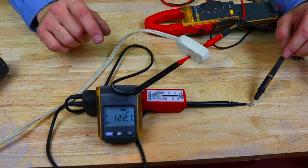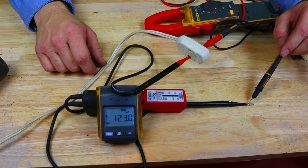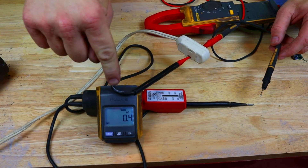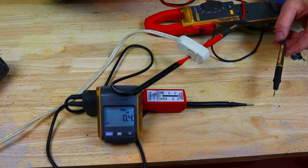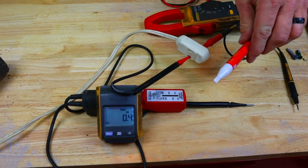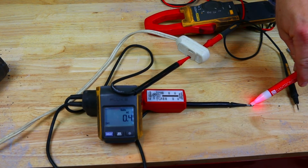Believe me, when you've got 277 and you grab the other end of this lead right here where I'm tapping, it will light you the hell up. So you can see here are the two Fluke leads, and here are the two wiggy leads — it goes in one side, comes back out, right up into that lead. If I was to touch that it would shock the crap out of me. I'm going to show you on a tick tracer now — still got everything plugged in. You see no voltage on the tracer, but when I touch it — boom — there's 120 volts sitting there waiting on you.